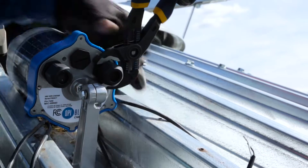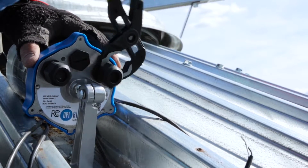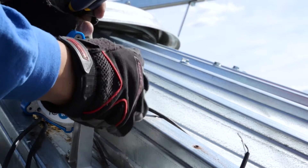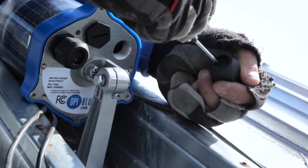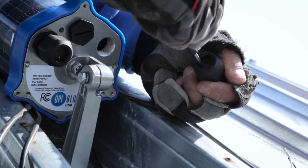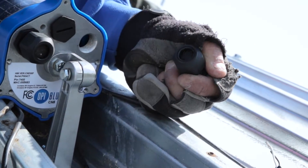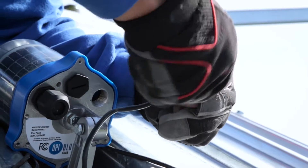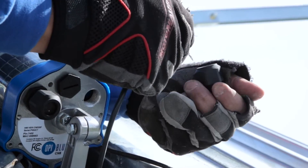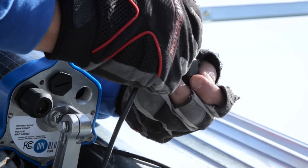Note: there are two strain reliefs on a multi-cable node and each strain relief contains four small membranes for cables to connect into. Use a small screwdriver to create a small opening in the membrane in order to be able to insert the cable lead wires. Pull 2 inches or 5 centimeters of lead through the membrane for each of the cables.